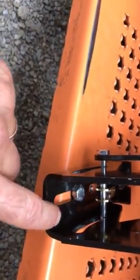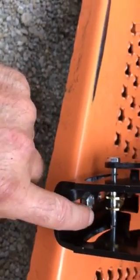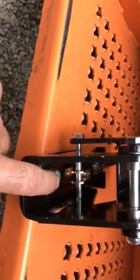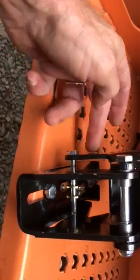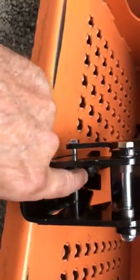When you put these bolts in on this — on the V-Ride — you need a two-inch by five-sixteenths bolt, and that typically is not what comes in the kit, so you'll have to come up with one of those. Put the heads on top, pointing down so that they don't get in the way of the clevis moving up and down or the cable.